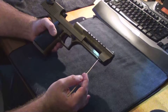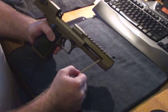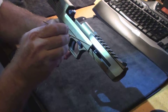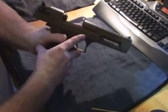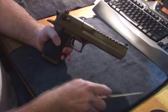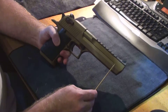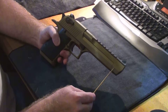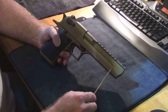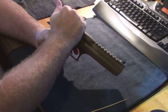The gas channel runs the entire length of the bottom of the barrel to the very muzzle, then takes a 90 degree turn and comes down into the actual gas bore. You can see the gas piston there, mounted inside the slide itself. The sequence of firing is: the hammer drops, the weapon fires, gas is tapped off underneath the projectile, travels down a 2mm diameter channel along the bottom of the barrel into the gas bore, pushes the piston back, and reloads another round.